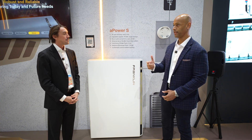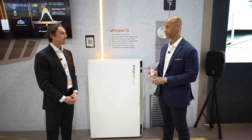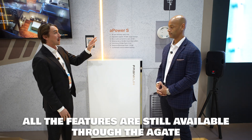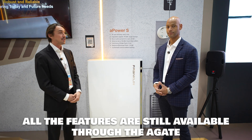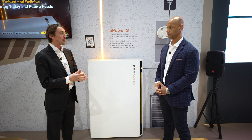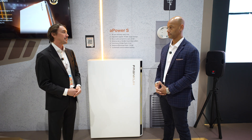With the A gate, you're still getting the smart circuit option and the generator recharge option. All of the features everyone knows and loves — smart circuits, the generator module integration — and now we have our V2L integration as well. All are still available through the A gate. Additionally, it can couple with existing AC solar systems, so even if a homeowner has a legacy PV system but wants to add PV and battery, we can also work with existing systems.